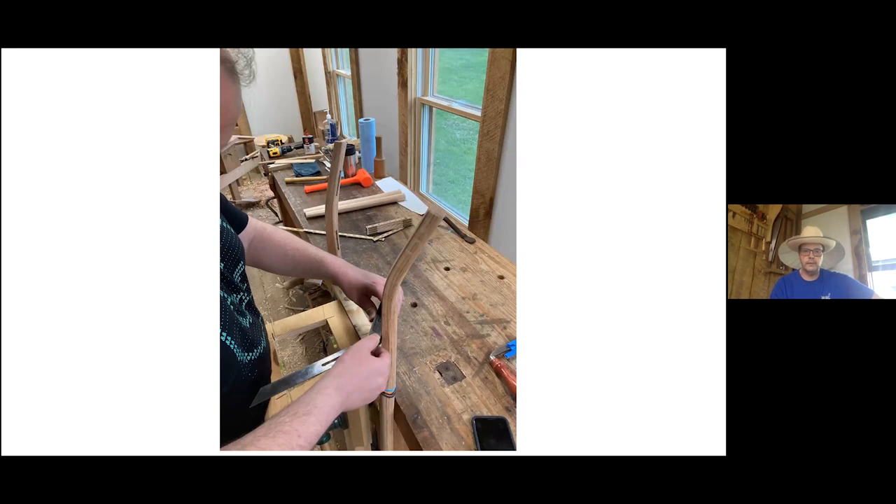Here is part of one of the techniques of making these chairs — finding the angle to drill the holes for the side posts. You have a seat that's representative of the actual dimensions and angles. What this person is doing is putting a bevel gauge up against the flat of the back post and referencing it onto what's called a potty seat — a geometric representation of what the seat would look like. It has the angles at the corners, so if the angles up at the chair top are pleasing to the eye, you can use the side angle to reference off that post to get the angle you'll drill.